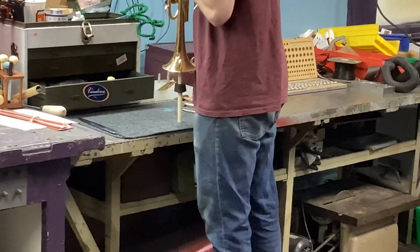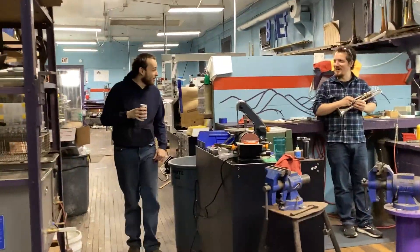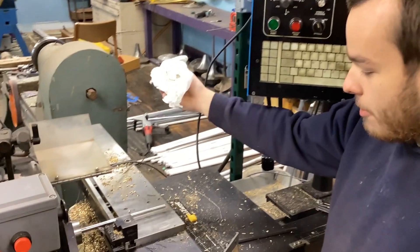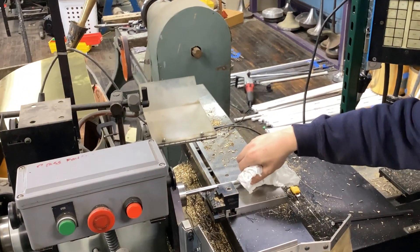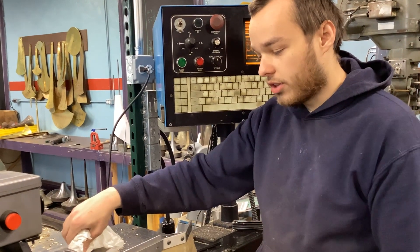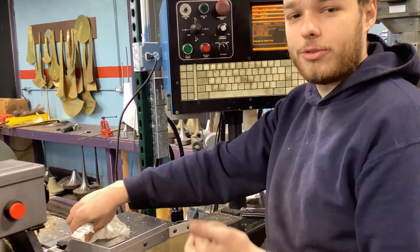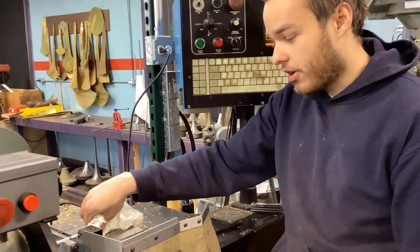Halfway there! Our band name is called Weird Al Yankernit — it's a parody, so it's funny, so it's fine. It doesn't have that much stick out, but it doesn't matter because it's like a Swiss lathe — like a zero-point cutter. I just hold it so it doesn't vibrate as much, because we're not actually cutting at zero point — we're still about an inch and a half off the chuck face. If this were a real Swiss, the cutter would stay stationary an eighth inch from the spindle and the whole bar moves. It's pretty cool. You want to make really good lead pipe mandrels? Do it on a Swiss — it would be awesome.